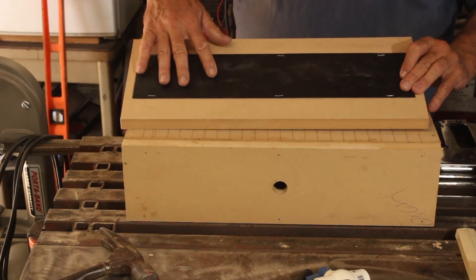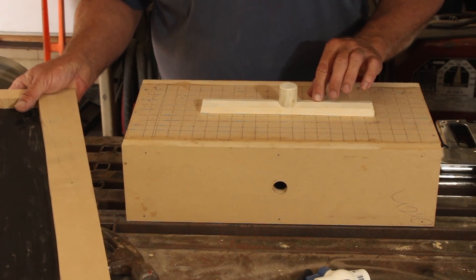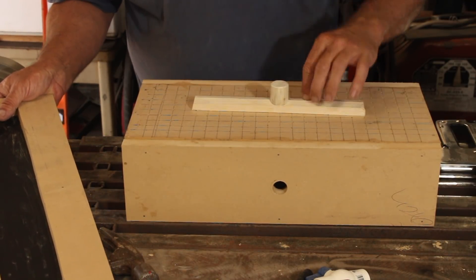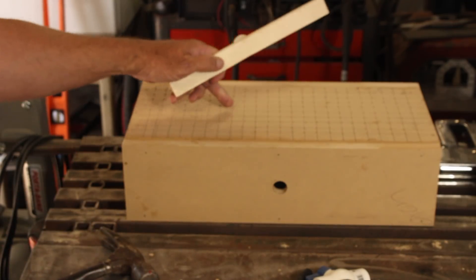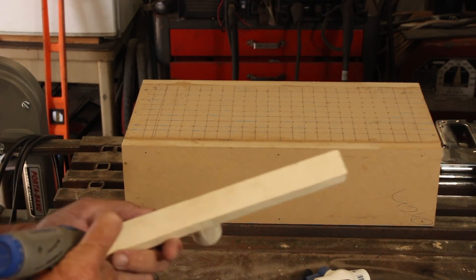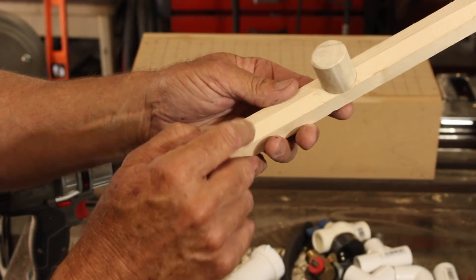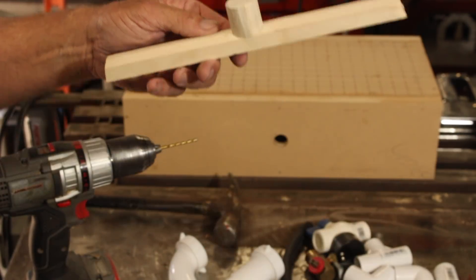Here's the framework. To attach the ABS plastic, I just stapled it onto the back of the framework. The next step is to put vent holes through the form so the vacuum can get from underneath it out to suck the plastic down onto it. Rather than match-drilling all the holes, I'm going to gouge out a channel and then drill holes from the channel out. I put a pretty crude gouge down the middle and now I'm just going to drill some vent holes.